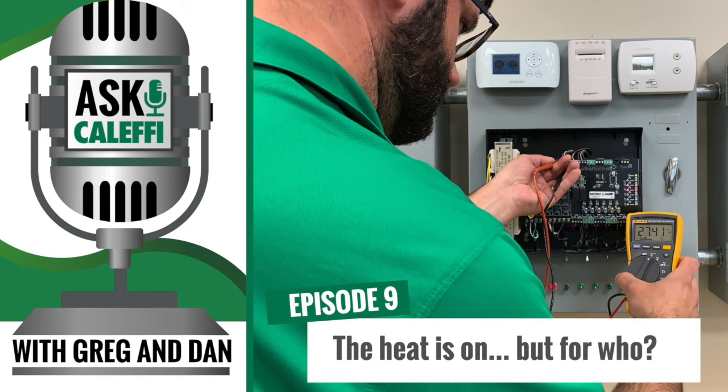There are so many different ways it could be — is it a thermostat issue, an actuator issue, a board issue, or a piece of wire? I've seen new thermostat wire come off the roll and be shorted internally. There's one manufacturer of thermostat wire with a strip string — if you pull hard on that strip string and it binds, you're actually skinning the wire insulation off. I stripped it about two feet in once and found three of the wires had been skinned. If I would have applied any power, they would have shorted. It doesn't take much.